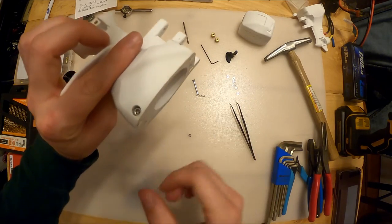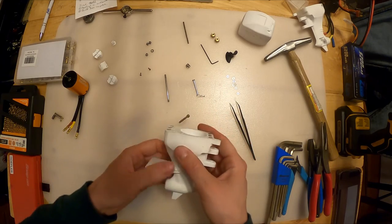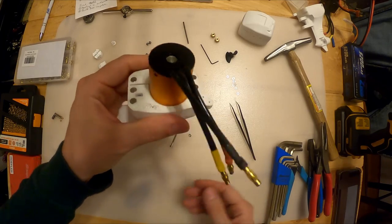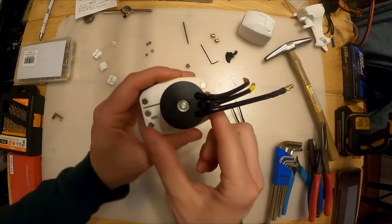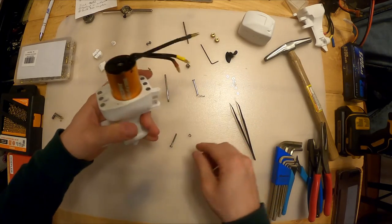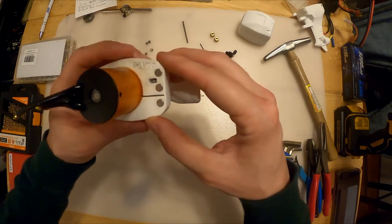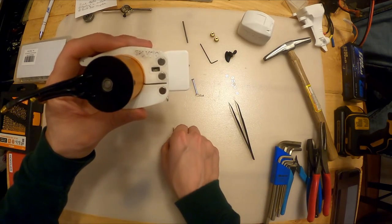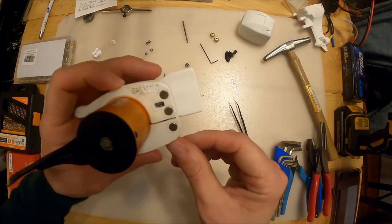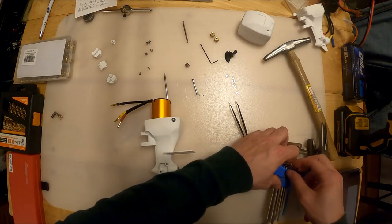You take this M3 socket screw, that's what fits on the side. You tighten that and it squeezes the motor together. So you put the motor in - it fits into its socket like that, nice. You'll say, hey it's going to spin while it's running - well yeah. So you drop this nut in the hole and the hole is sized so the nut can't spin.